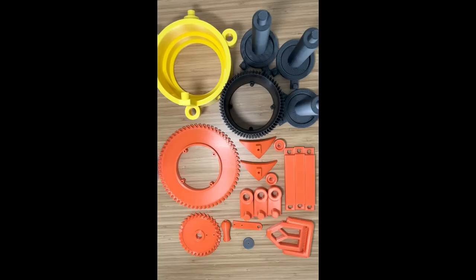Sir Knits a Lot, as I will be referring to him for this video, recommends that you use a PLA filament on 100% infill. That creates a heavier, denser material that seems to be harder wearing and will last a longer time. We had originally printed this piece on a smaller infill and then had some issues with some cracking. He kindly reprinted it for me, and it's much heavier and denser. So I feel like it will be more of a workhorse for me.